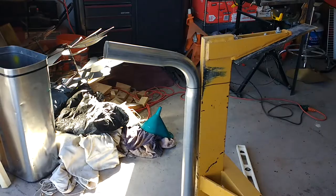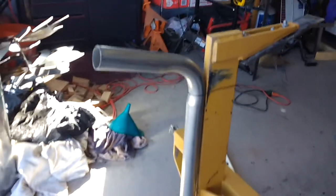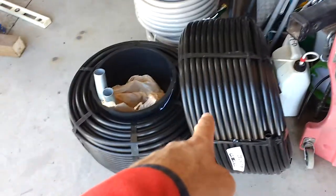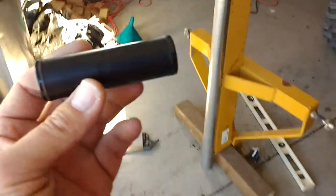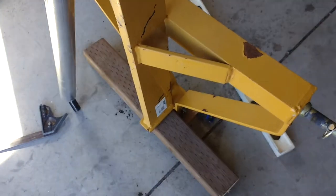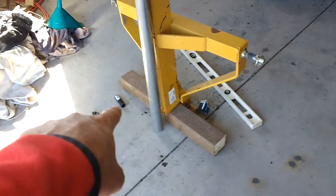I didn't angle it at quite 90 degrees — it's an 80-degree bend. We did lose a little bit of internal diameter there but I don't think it's too much because it's two inches. With inch-and-a-half I was worried I'd lose too much. I've got 600 feet of run to do in one spot and two 500-foot spools for two different areas. I'll have to do 500 plus 100 to make that run. I wanted to make sure the pipe coupler will go down through the bend — and it did come out the bottom — so that tells me it'll make the bend easily and I can connect pipes when I get low.